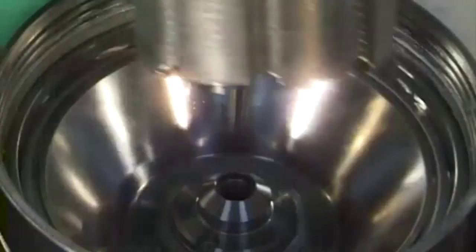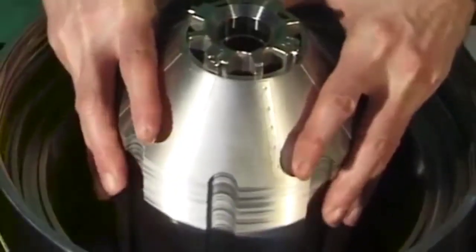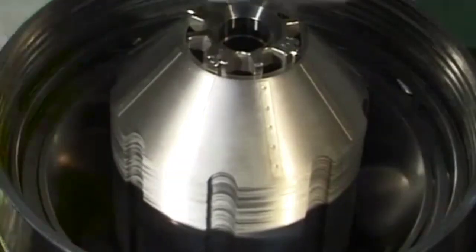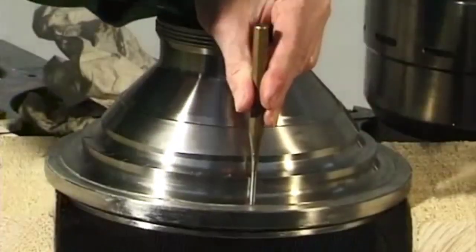Unscrew the spindle screw. Stack the disc stack on the distributor neck. Install the distributor together with the disc stack. Pay attention to correct positioning. The O marks must be aligned. Mount the separating disc. Pay attention to correct positioning. Replace the polyamid gasket only when it's damaged.